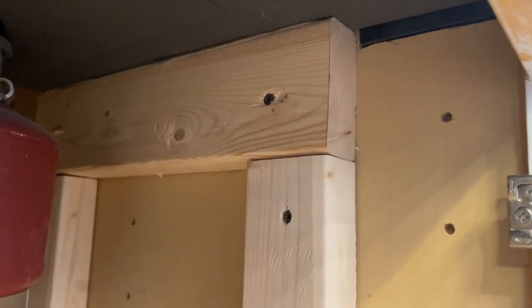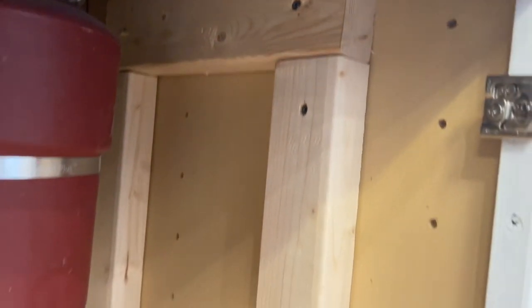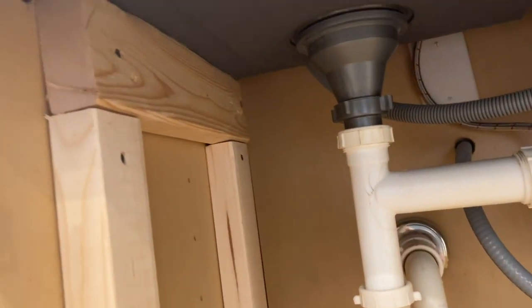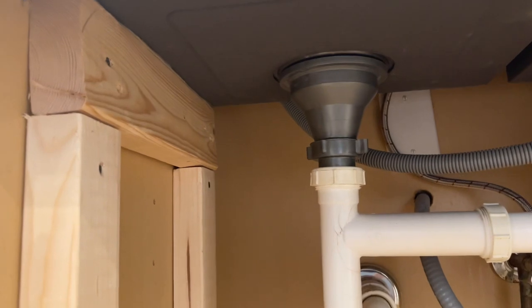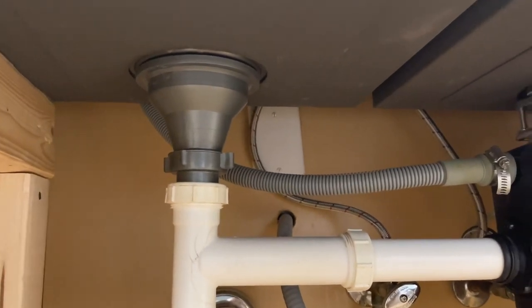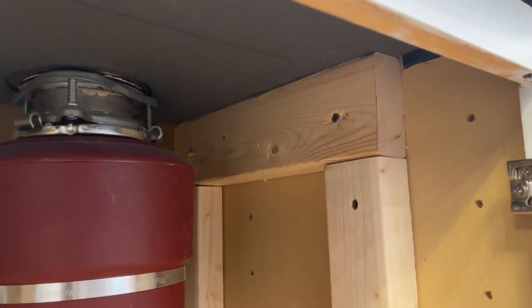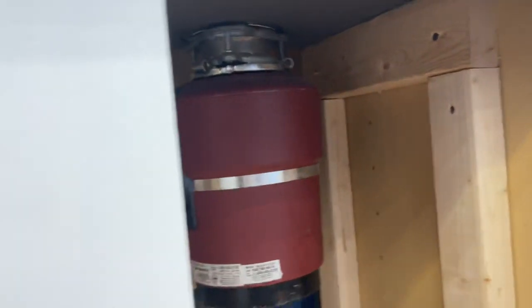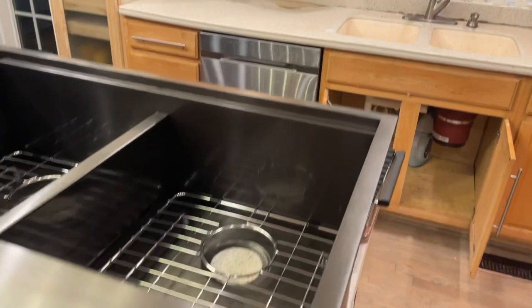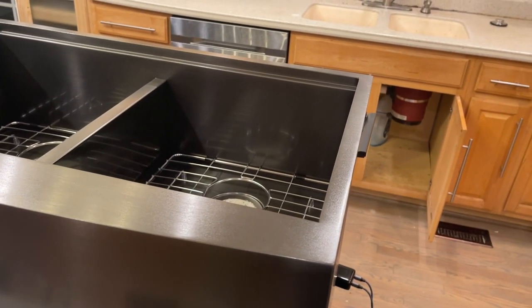This is the detail of the install. I had to notch out the side of the cabinets, then I used 2x4s and 2x3s as support legs on each side, made sure it was level, and glued it with granite and marble construction adhesive. This sink is not going anywhere. These cabinets were about 22 to 23 years old, but all in all it turned out very well — the installation is clean and the sink wasn't that hard to install.